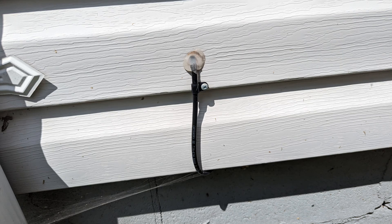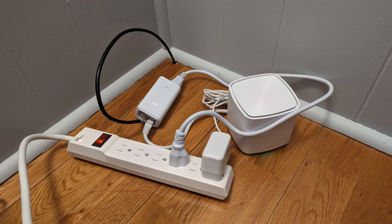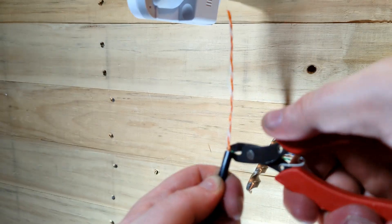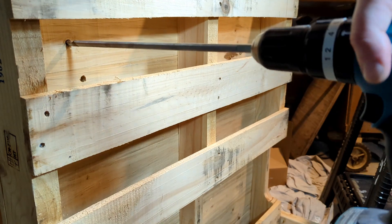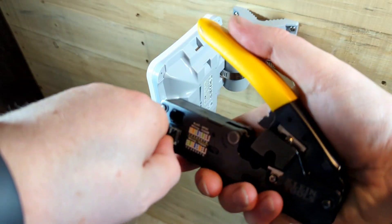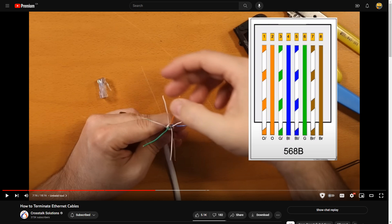For the rest of the run, it's often easiest to run it on the exterior of the building. If you have vinyl or aluminum siding with trim along edges and corners, you can often tuck the cable behind it to hide it and hold it in place using fewer fasteners. For other sections, use cable clips with screws or nails. If your router sits near an exterior wall, you can pop through the wall. For buildings with unfinished basements or crawl spaces, go through the outside wall into that space and pop up through the floor. You'll need a drill bit at least 3/8 inch diameter and 12 inches or longer. Bell hanger bits let you feed the wire through the tip to fish it through. Add a drip loop and seal with exterior silicone.